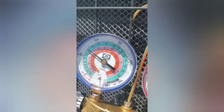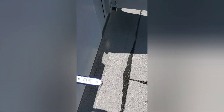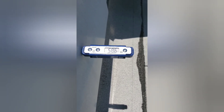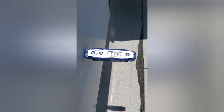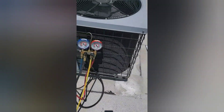We have about 70 psi over 300 — so about 70 low and close to 300 high. Looking pretty good. Checking our supply one more time — now we're actually at 58 degrees, so we're actually dropping the temperature in the room. The supply is dropping — now it's 78 in there instead of 79. So it's dropped a degree and we have our 20-degree split. There you go — 59 degrees. Looking pretty good.